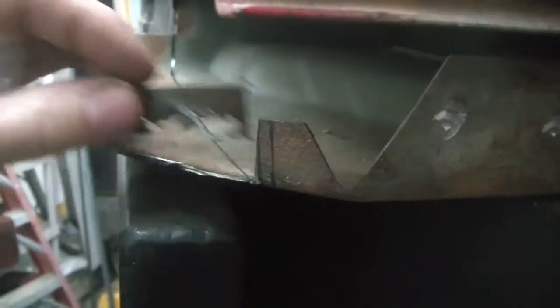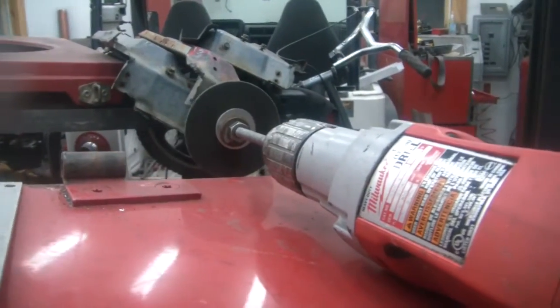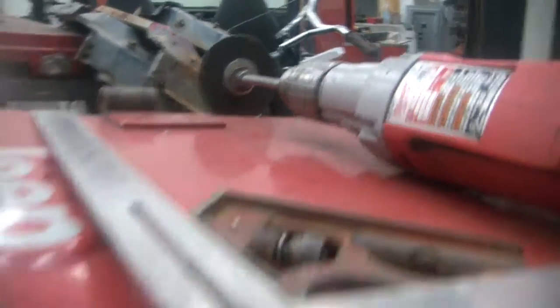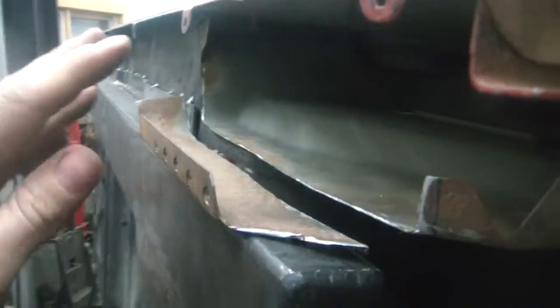I think I'm going to cut on this one — not one-eighth. I notched this out and was able to get my straight edge in here a little bit and put my line down. I've got a cut-off wheel put onto a carriage bolt in a drill and I was able to notch this out in the corner. The cut-off wheel on that carriage bolt in the drill did not cut this very fast but it did a good job.